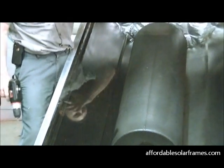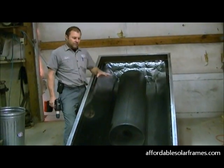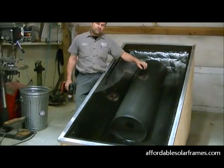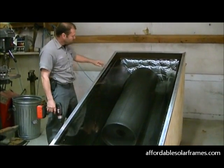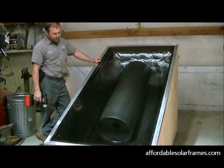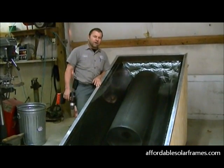When it gets to its destination, they can take the glass off and take the tank out — it doesn't weigh so much that they can't handle it, get it in place, and put it all back together. This should save you about $30 a month, heating water up from 68 degrees to 120 to 140 every day on an average sunny day. It's a 50-gallon tank. We sell the aluminum frames — if you want to build this yourself, just contact us through YouTube. Thanks for watching.